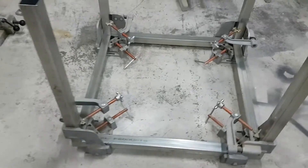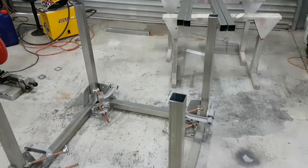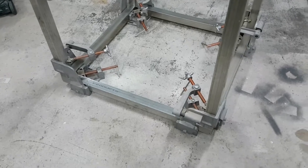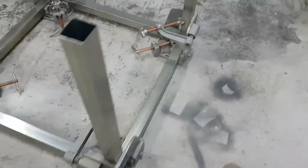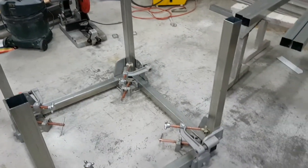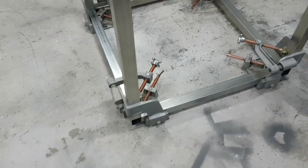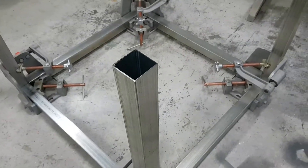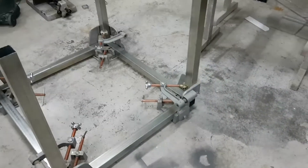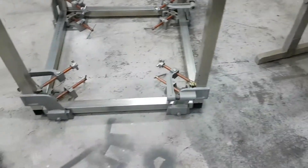G'day, Michael here. I've reached the point of no return - I've cut the steel framing for the outside, which is basically a containing frame for the whole assembly of the new CoreXY printer. I'm kind of sick of all the wobbles you get in assembled kits, so I've decided to make sure I don't get any more wobbles than necessary. I'm using 50mm square tubing; the box is 900 high and nearly 900 cube - 860 by 860 by 900 is the size of this fully assembled frame.